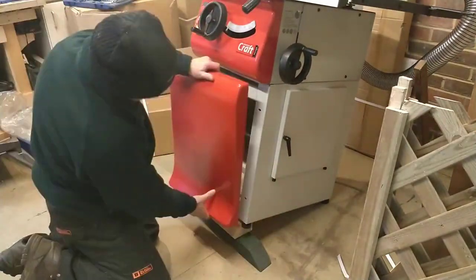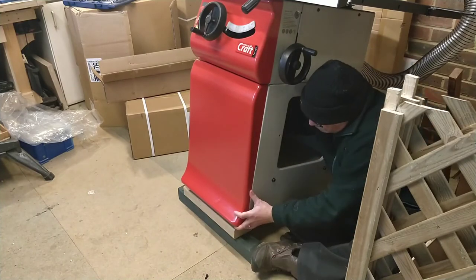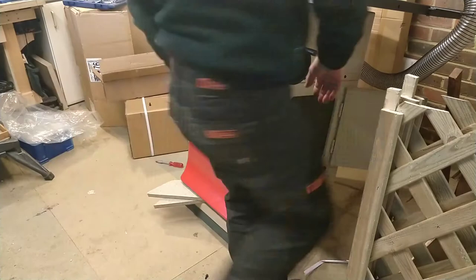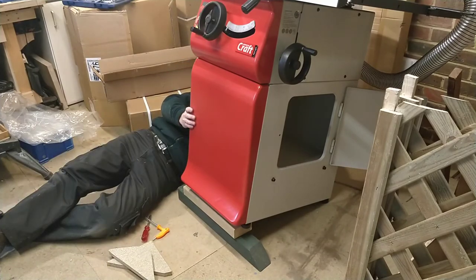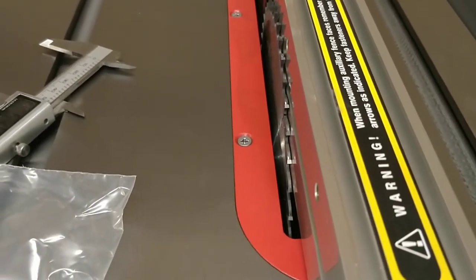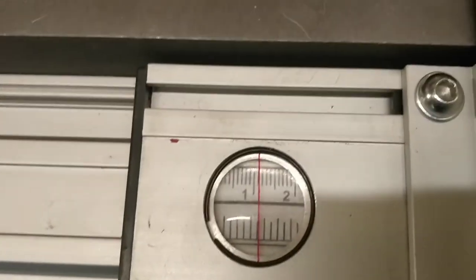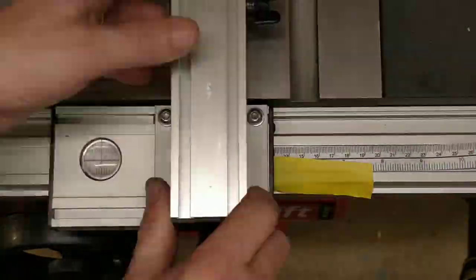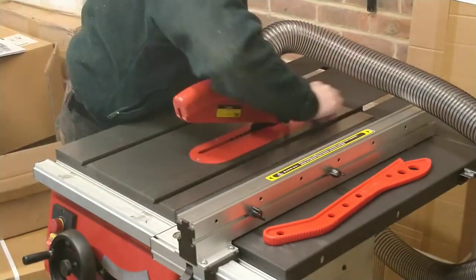Finally I fit the front on the cabinet — I think I should have done this earlier. In the absence of anyone to help me move the saw, I prop it up to gain access to the fixing points — probably not very safe, so avert your eyes. I set the fence up so it's just not touching the blade, almost touching, then move it to zero. It's finally time to tidy up, remove the grease on the cast iron bed, and treat it to some machine wax. And that's it — done.